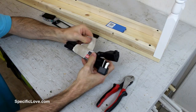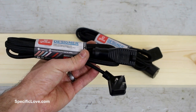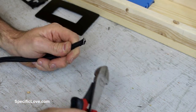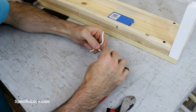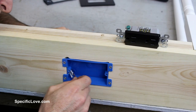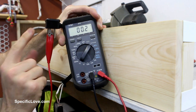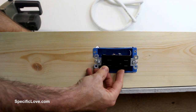With the wood complete, it was now time to wire up the outlets. I purchased two seven-foot three-prong extension cords with a black fabric-type outer layer that will look nice with the table. I then cut off the large female end and stripped back each of the wires. For the outlets, I chose some bronze colored versions and some screwless wall plates that will match the stain we plan to use. After I fed the wires into the box, I grabbed my tester and made sure to find the wire that matched each prong so I could wire up the outlet correctly, and then I screwed it into place.